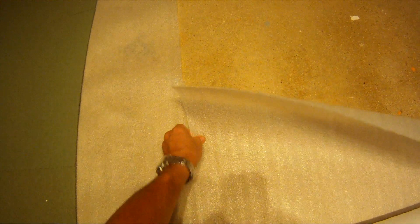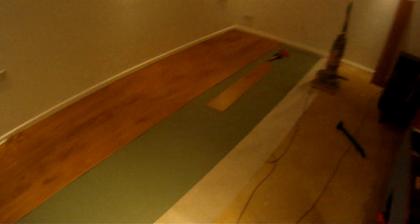That's your basics. When it comes to doing the next row of foam — which is also the damp proof course in this instance — I tape them together with a bit of duct tape. Any tape will do that's going to stick these two together, and of course plastic being waterproof continues the damp proofing course and stops any damp from the concrete coming through.